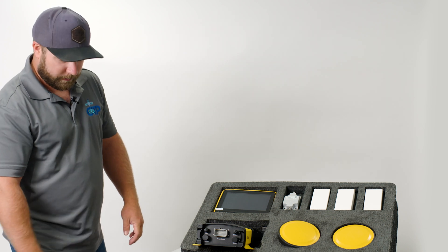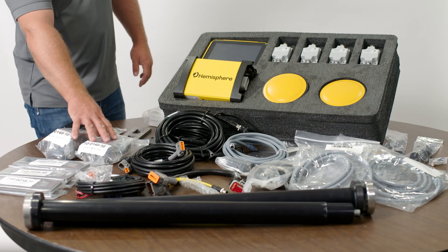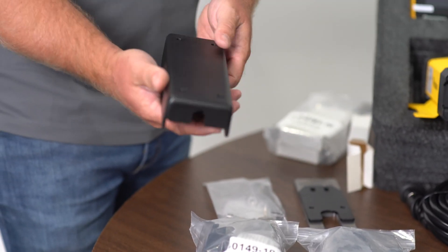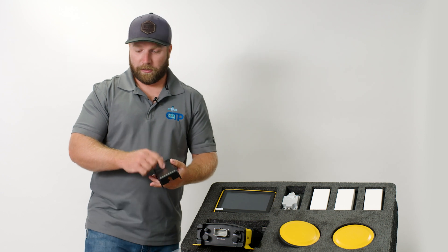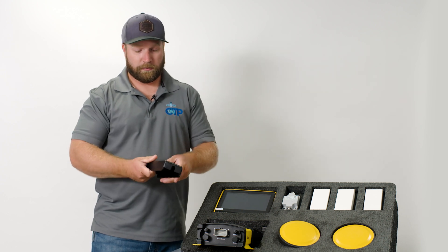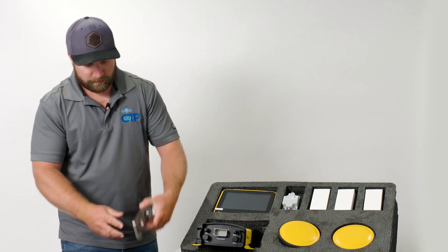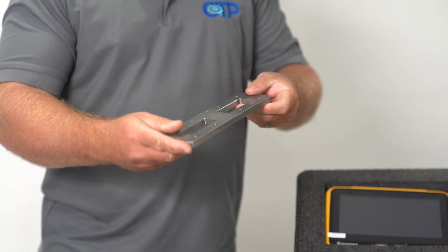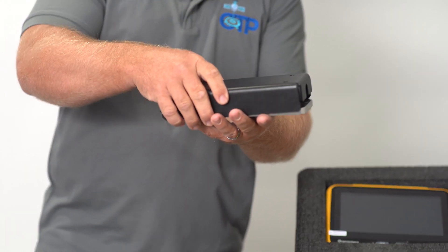The part that I think we've really done a nice job on is the sensor mounting. The kit comes with these weld-on mounts — four of them for each sensor — and one covered sensor mount intended for the bucket. When we install these kits we actually add covers to the bucket and the stick, and if the customer prefers, on the boom as well, just for a nice clean look. These are powder coated but we can paint them to match the machine for a factory-installed appearance. They're weld-on mounts where we weld on the inside, so we're not creating any stress risers on the installation. This gives a really nice low-profile install that won't stick up and create an obstruction that could get caught or damaged.